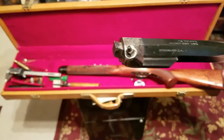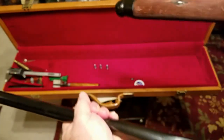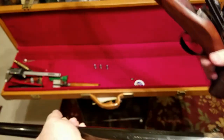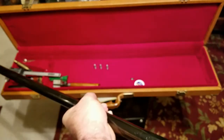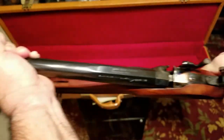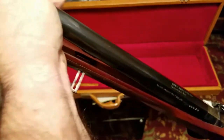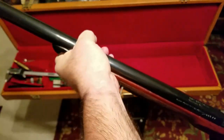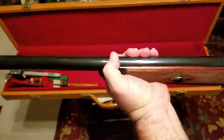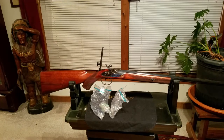This is a very unique design. When people don't know black powder guns — there's a lip right here that comes up, and inside the forestock there's a rectangle hole. You just put that lip in here, let the barrel set down, squeeze the barrel into the forehand stock, and push this pin all the way through. Now your barrel is locked. That's how the hook breech assembly works.